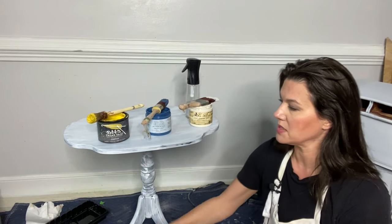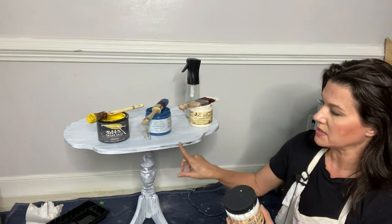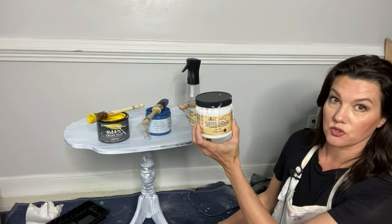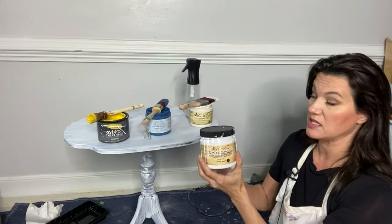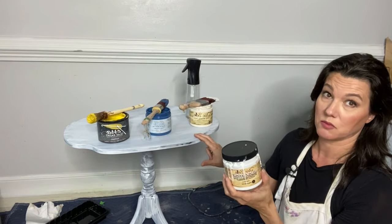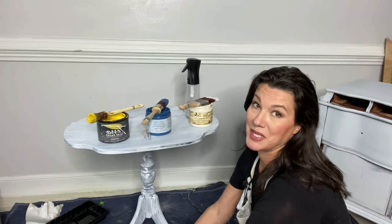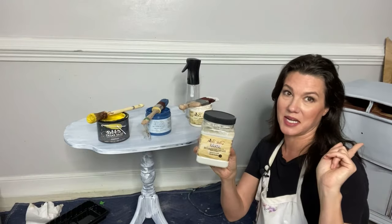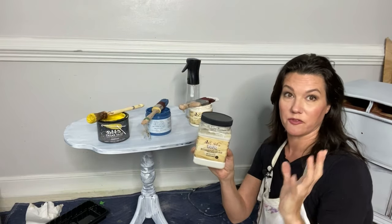We also talked a little bit about Slick Stick, which I used on this project right here, because this is a heavy style of shiny Bombay wood. Slick Stick is your gripping primer for anything slick or shiny surfaces: paint metal, paint glass, paint fake wood, plastic wood, whatever you like, all right? And then pieces like the one behind me, you need a primer like Boss. This was done in Boss in gray to get ready for paint.